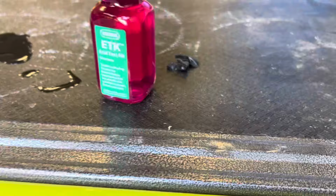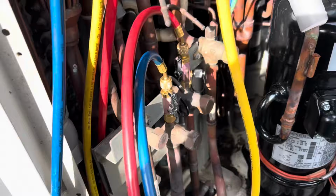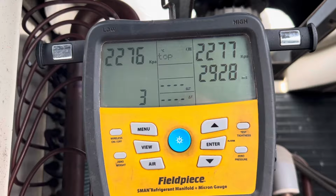Cool, I think we're all sweet. So, according to this, we're safe. After 30 minutes, we've gone up 3 kPa. I ended up taking my clamp off because, maybe you've picked it up during the video, it's pretty windy, and then the sun started hitting it and it was throwing my readings all over the place. So I figured I'd just do it this way. But honestly, I'm really happy with that. So we'll let the pressure out and get this thing on vac.